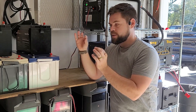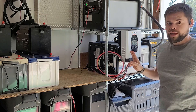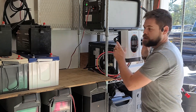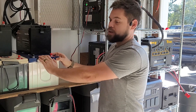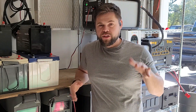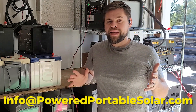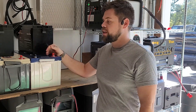You do want to have some experience if you're doing your own DIY system, because you're going to need a charge controller. You need to make sure your charge controller can handle enough solar input to recharge the batteries properly in a single day, while the batteries are able to run your vital equipment — like an air conditioner, fridge, freezer, lights, fans, TV, Wi-Fi, whatever you want to run. If that sounds complicated, send an email to info@poweredportablesolar.com and we can help guide the sizing of that system so you know exactly what you need.